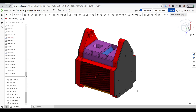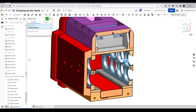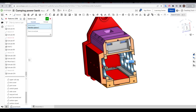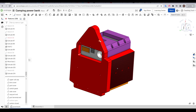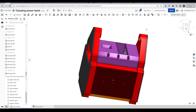With that direction established I kept designing, and here's what I ended up with. It's best explained with a section view looking inside. On the top and bottom we have caps that cover the ports and the BMS, but we leave the BMS heatsink exposed to help cooling. On the sides are two symmetrical pieces that internally give a little room for the raised battery terminals, and on the outside I added a flat knurling effect from simple extruded cuts. A printed piece slides over all of this, then a carbon fibre plate goes over the top. Finally, a bore on each end plate accepts a carbon fibre rod that acts as a handle.